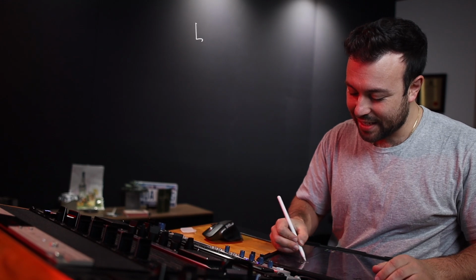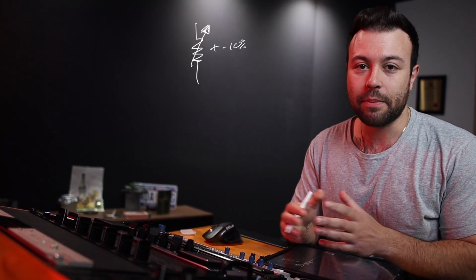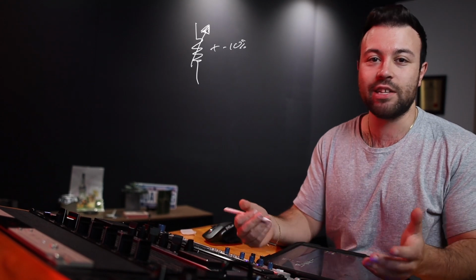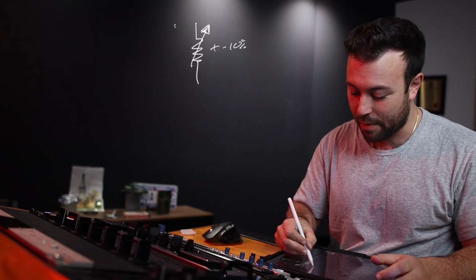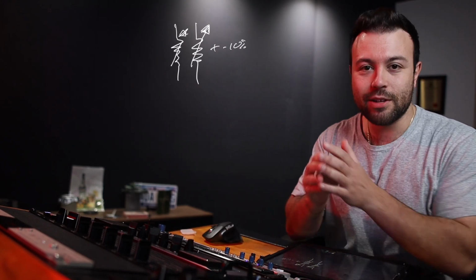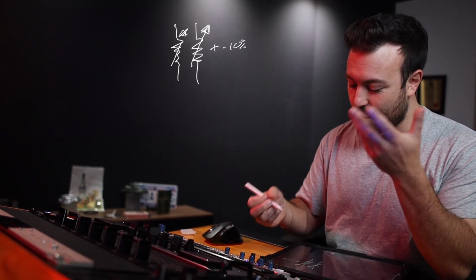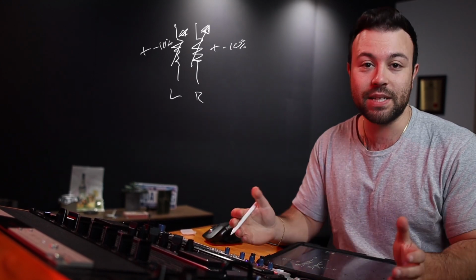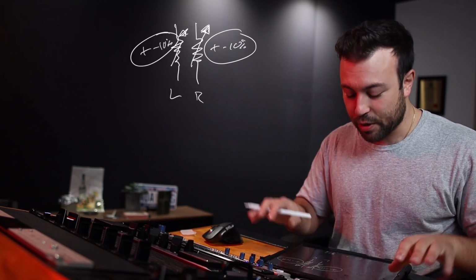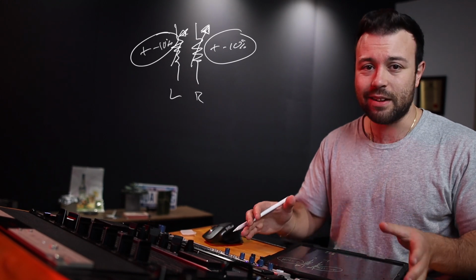A potentiometer is a single variable resistor, and that can vary in tolerance between plus or minus 10%, depending on how it's graded. Now, previously I used a Crane Song IBIS EQ, not the mastering version, and matching the left and right channels' gain parameters using pots was a bit of a nightmare, because it's hard to reassign, especially on recall, identical left and right settings when each channel has a variance of 10%. And these variances between the left and right channel potentiometers are a workflow nightmare when it comes to mastering.